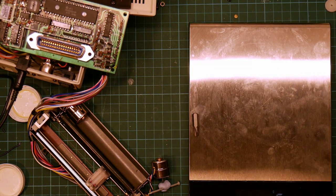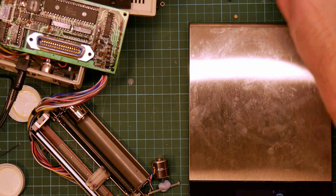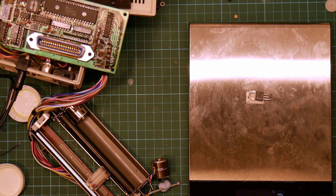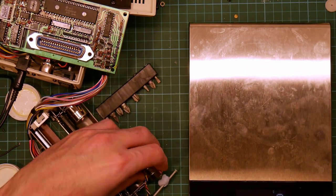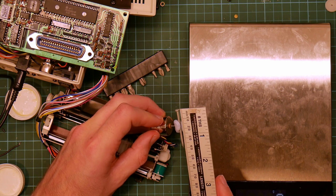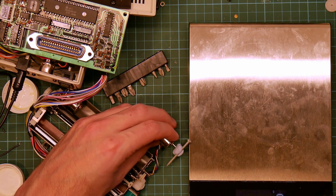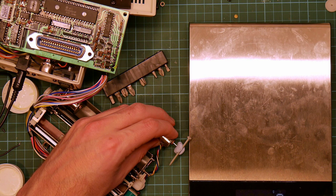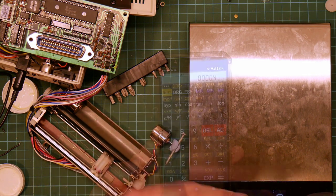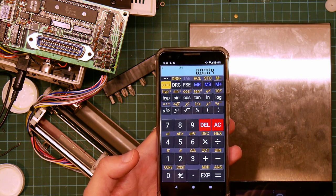What's the smallest amount this thing can measure? I've got some of these — five grams. Still five grams. So I know it's less than five grams. This is a bit bigger — two grams. Two grams. So at a distance of call it 20 millimetres, it's producing force of less than one gram. You measure torque in newton metres — I'm getting a torque of less than 0.0004 newton metres. I think that is not enough, and it is broken.